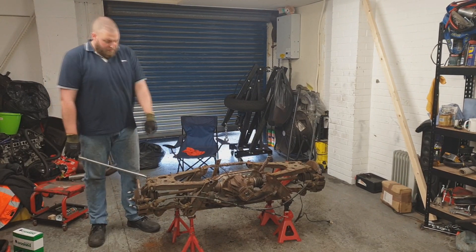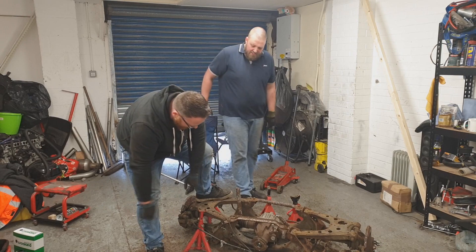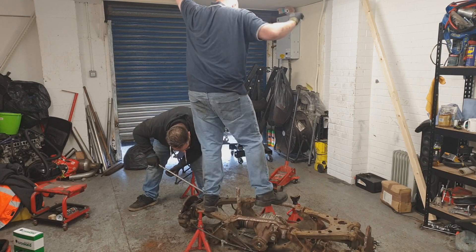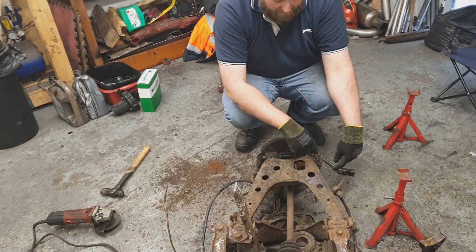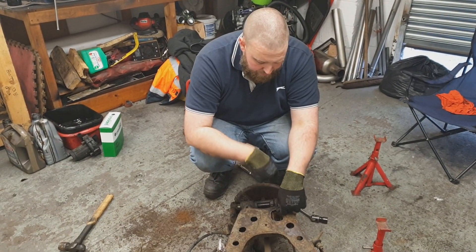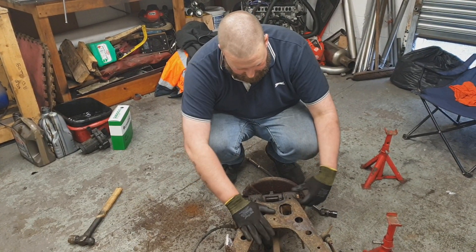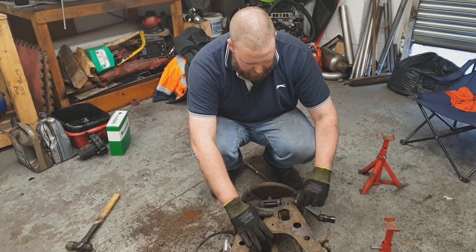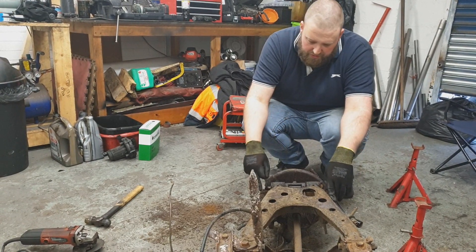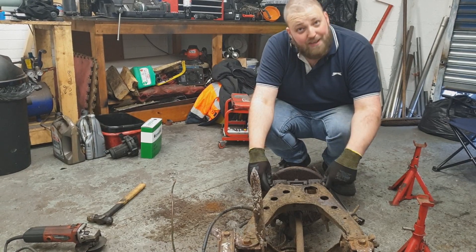Tommy, can I borrow you? Absolutely. Can you put your foot in that — it's going to rough you up. Let me distribute my weight across this. And the bolt's not moving. Here's the challenge: a big long bolt with nut on the end which holds the lower arm onto the hub. Cut the nut off by grinding off the end of the bolt, so there was nothing for it to really cling on to. However, the nut out of the bolt is not going to come out. So, in light of the fact that we've had abysmal failure with traditional methods, we're going to take the grinder and cut a slit across here on the lower arm, and then effectively feed the whole lot out. We want to retain the hub. Don't buy an old MX-5.